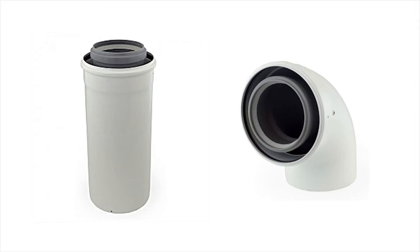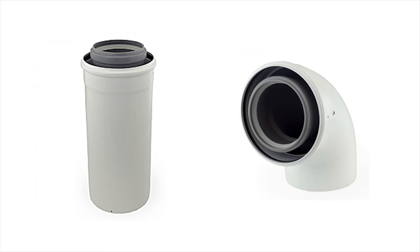Two subcategories of Central Therm piping are Flex Vent pipe and Concentric pipe. Concentric pipe is a two-in-one flue exhaust and air intake pipe — the air intake is from the outer circle and the flue is on the inner circle. Flex Vent is a flexible polypropylene flue exhaust pipe. However, these options are a little less popular because they can be more expensive, or in the case of flex venting, just less durable.